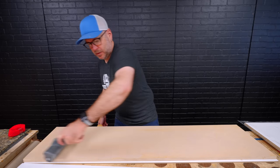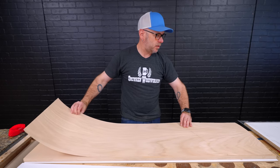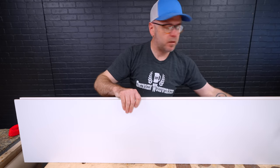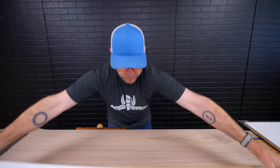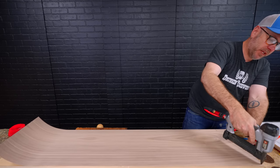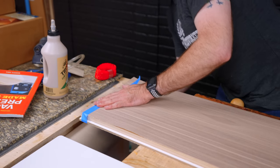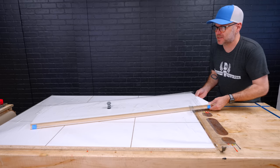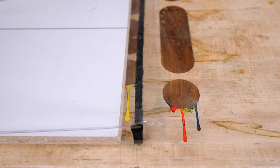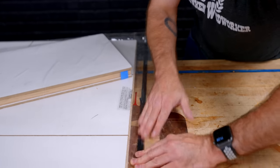We've got glue on both sides of the plywood substrates. I'm going to put this on the floor so I can step on it in a little bit — put in our oak and our bottom caul. Now to keep things from moving and sliding around in the bag, you can use tape or a little brad pin. The brad gun isn't working so we'll use tape. Now I can take the sandwich and put it in the vacuum bag. I am maxed out on the size here, so I've got to angle it just a little bit. This bag has a gummy-like substance on it that's reusable — I pull off the protective paper and mush that down to create the seal.